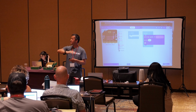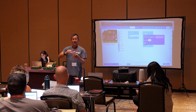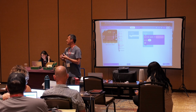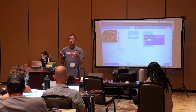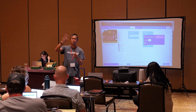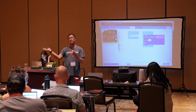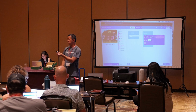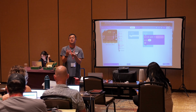So it does a half circle that it can do, okay? And your signal that you tell it is an angle you want to go to. So maybe I tell it, I want you to go to 0 degrees, and then 90 degrees, and then 45, and then 180. And so it'll go through to those specific positions. Okay? So that's how you would program a servo like that.